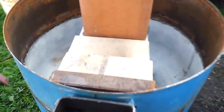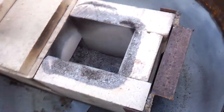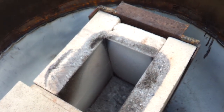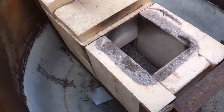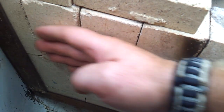The main thing here is that the burn chamber initially was a cross section of four and a half by nine — the full size of one brick. The problem I was having was getting a good rocket effect through here. I'd get a lazy float and flame that would just slowly waft into the fire tube, and that wasn't doing what I wanted it to do.